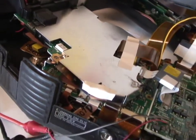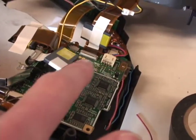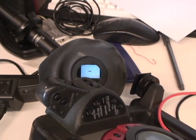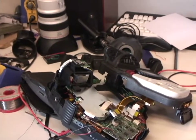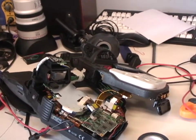Now a while back there was one problem — it worked for a while and then didn't, and there was a bad ribbon cable underneath here that didn't seem to be seated properly. If I press around on here you might find the picture goes funny — there you go. I'm not sure if that's a problem with the ribbon cable or the connector. It shows that the camera does actually work and that this little disaster with the voltage regulator didn't actually kill it.